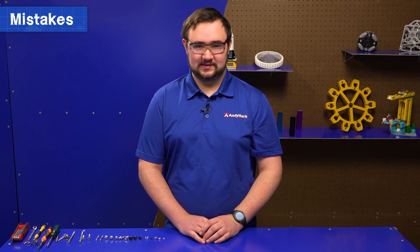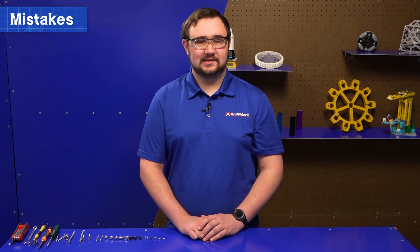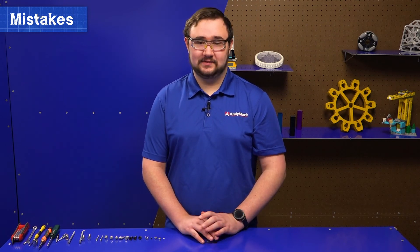Finally, let's talk about cross threading, head stripping, and other fastener failures. Cross threading occurs when the screw is not placed into a nut or threaded hole properly, and the threads on the screw and the threads you're screwing into cross. If a screw that shouldn't be tight yet suddenly becomes tight after placing it in, you can generally assume that you've cross threaded it. To fix, simply unscrew it completely and then try again. Do not try to push through resistance in this case — you can damage both sets of threads and make the screw and nut or threaded hole unusable or unsafe to use.